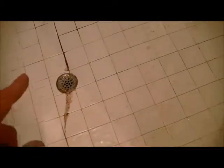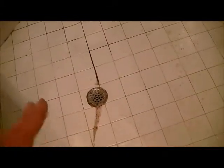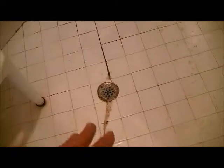So this shower will get a complete makeover. I believe this bottom tile is either going to be 4-inch tumble marble, or it's going to be a rock type tile, which is always kind of nice to get rid of all these angles. There's a lot of cuts. These diagonal tile that go across here didn't start as a diagonal, they started straight, but this line isn't straight. So to negate any type of angles, we're considering using the stone type tile, and that will probably work in pretty well. So it'll definitely be a profound difference from before and after.